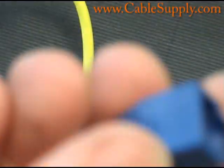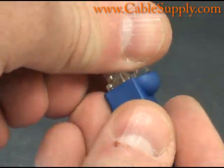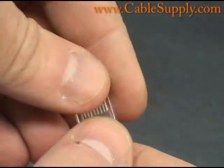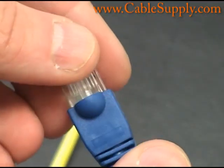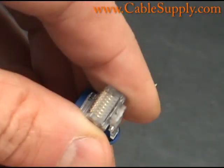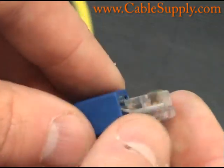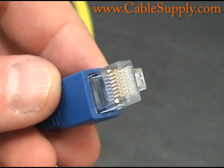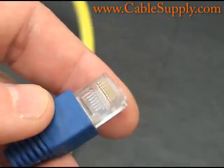Some of the other accessories: if you're making your own patch cords, you would want to use a boot. This boot slides right over there — slide your cable, actually crimp down your cable first, and then slide your boot over it. You can make your own patch cords, though I don't recommend it — they're too inexpensive. Anyway, that's an RJ45 with eight conductors, and an RJ11 mod plug. The mod plug itself can take up to six wires — what they call three pairs — and is not used for computers.